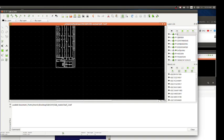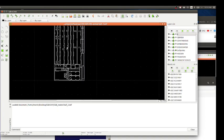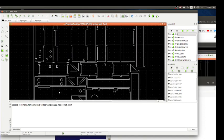You can actually take this to a local fabricator, and pending any interoperability issues, they'll cut it for you right away. Last time I took this, some parts weren't showing up. There are definitely file interoperability issues. DXF, you'd think that would be easily accessible by anybody, but there are different versions of DXFs, depending on the year it was produced. So last time we had some trouble, they couldn't get the part, so I had to send the file again. But typically this will be straightforward and you just get these things cut.